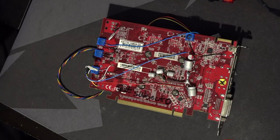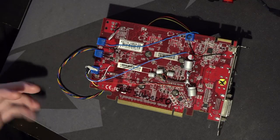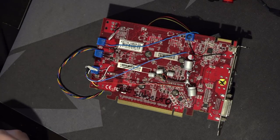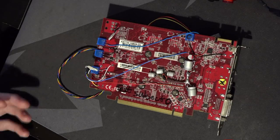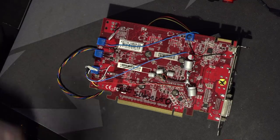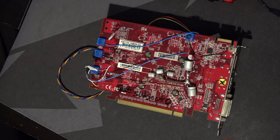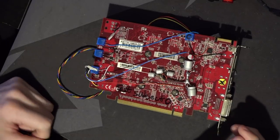That's kind of unfortunate, but it does mean there's less motivation to potentially break something. There are certain architectures where you can just keep raising the voltage and they keep scaling — and then eventually you hit a voltage where it stops scaling well, and then it's just dead, out of absolutely nowhere with no warning. That's really not fun. It's much nicer when you have a plateau, so there's no good reason to push 400 more millivolts in, and you just won't do it.